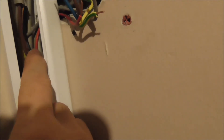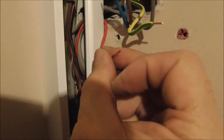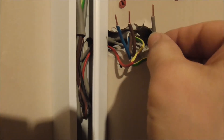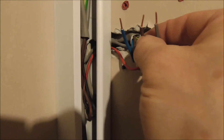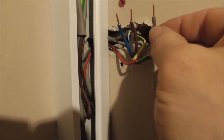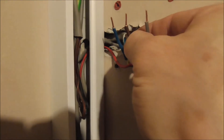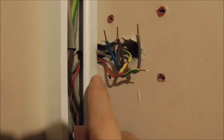I have just added a new connection. The red is from my programmer, which is on the other side of the wall, and there is a permanent live there. I just connect to the permanent live from the programmer, and we will need this permanent live for our new thermostat. This is the switched live from the programmer, which is going to be the input for the thermostat, and the output will be the switched live from the thermostat. This is a permanent neutral.